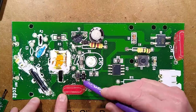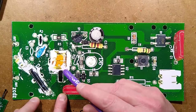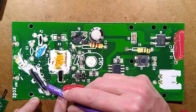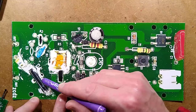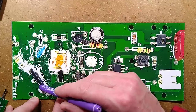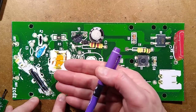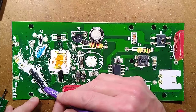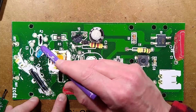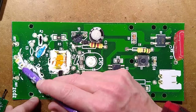And then the output of that, when that transistor turns on, it activates this circuitry and provides a stream of continuous pulses, and that is rectified by a single high voltage diode. Don't know what its rating is, because the way they mark these diodes, they don't put text on them, they put chevrons and shapes, but usually just at one end, just to avoid too much conductive ink, I guess. I'm not really sure, because it's high voltage. But that is then charging the 6kV 100 picofarad capacitor up, and then there's a current limiting resistor, grossly undersized, 10 megohm, going to the output.